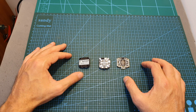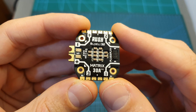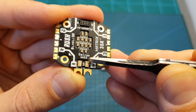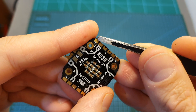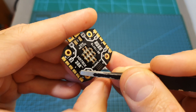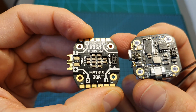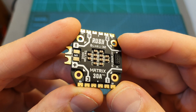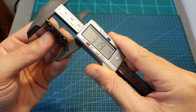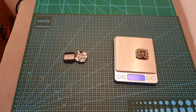The Rush Mini Stack is based on three components. The bottom board of the stack is the 30A BL32 4-in-1 ESC. It features a built-in current sensor and supports up to 5S LiPo batteries. The motor soldering pads are pretty big and can be found only on the bottom side, and the connection between the ESC and the flight controller is done using pin headers. The Rush Matrix 4-in-1 ESC is using 20x20 M2 mounting holes, its outer dimensions are 31.9 x 31.6 x 5mm and it weighs 6.6 grams.